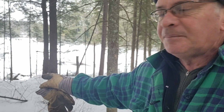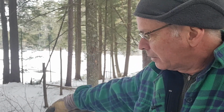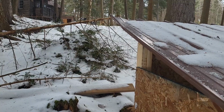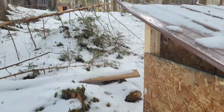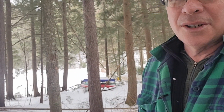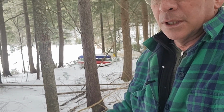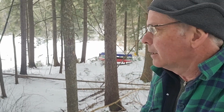That's where the pressure tank is, which comes up from the lake. I've got a deep well pump there. Several years ago, about 7 or 8 years ago, I dug a 3-foot deep trench under the ground here, so I have a buried water line. That's why I'm able to have running water, even in the middle of winter. The line was already buried from here up to the house when I bought the place. They had a point, which wasn't very good. It got filled with sand. It was really of little value. So I got rid of that, but used that spot to dig a deeper hole and have the running water.